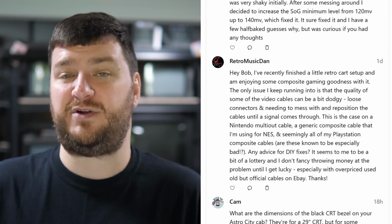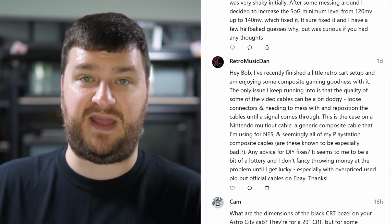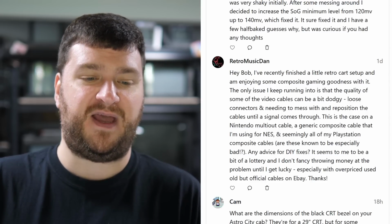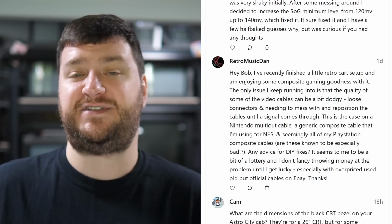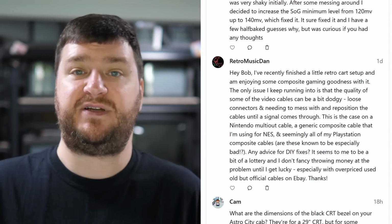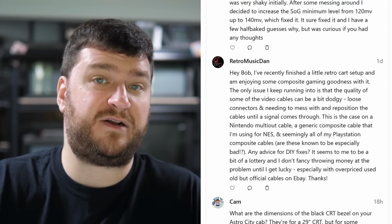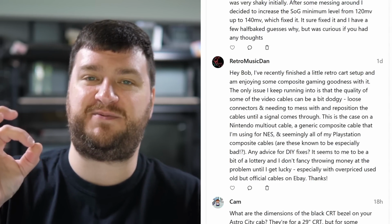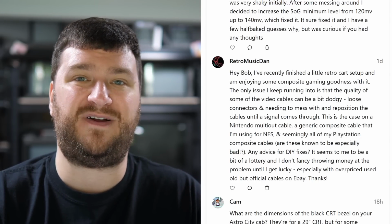And when you're talking about things that could be 30, 40 years old, it could very plausibly be that the cable, the RCA jack, and the switch all are worn down at the same time. But I would definitely try to figure out what the issue actually is and go from there. And if it's in your TV, it's possible that you could open that up and replace the RCA connectors directly in there. Or even if not, you could possibly direct wire to the board, so you just have composite video receptacle cables hanging out the back.